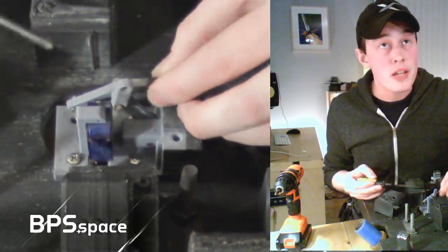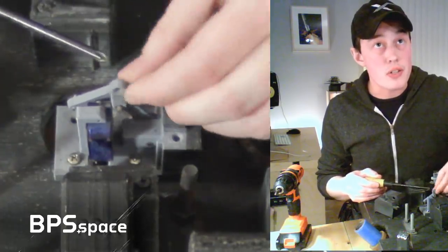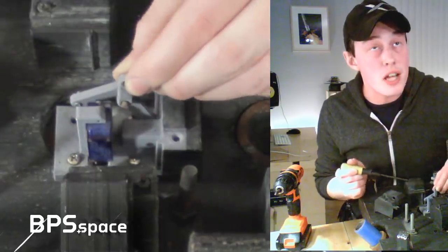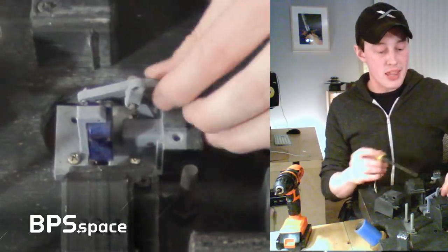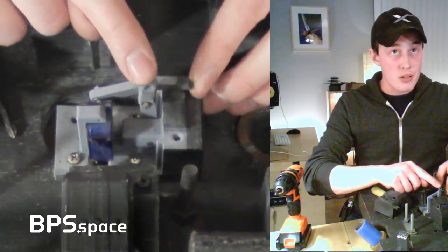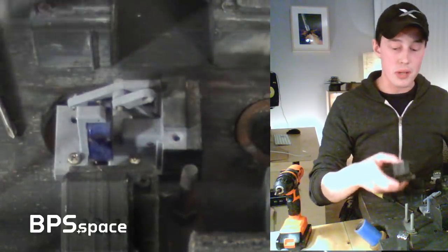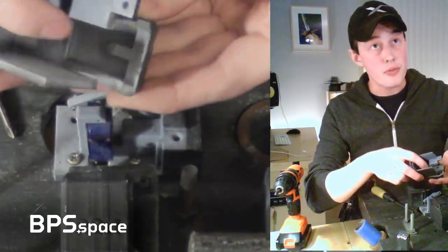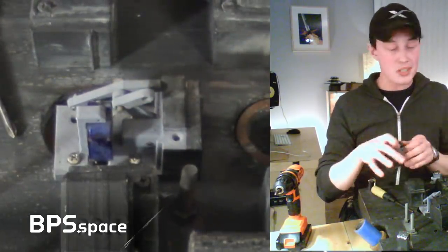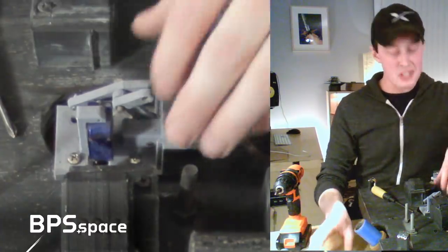It pushes the arm back. What I'm pointing at right now is the primary hold down arm that articulates back. There's a bit of a hinge right there. Boy, I don't know how well you can see it, but there's a bit of a hinge right there that moves back and forth. This helps the primary hold down arm move back. And then finally, there's this little guy right here. When the articulating arm pulls back, this little guy closes the launch clamp cover. And that's this guy right here. So that's how these covers close. It's all in one motion, actuated by one servo. There's a little hook for the articulating covers, and basically they open and close. And actually, that has been surprisingly effective. I just built these covers because I thought it would be cool to have covers on the launch clamps, but they actually do work. Yeah, surprisingly effective.